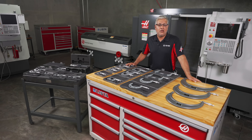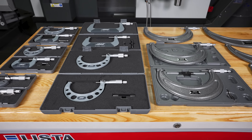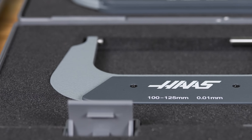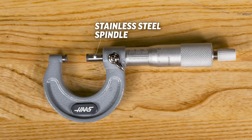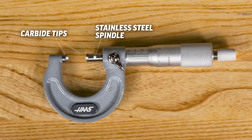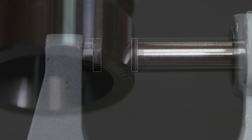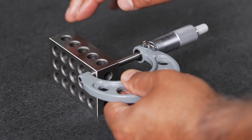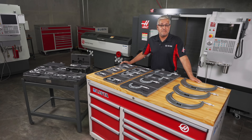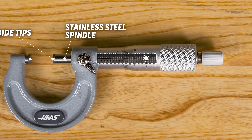Let's first look at our analog OD micrometers in detail. These are high quality precision mics designed to give you repeatable results over a long term. They are built solid like you'd expect. This mic has a stainless steel spindle and there are carbide tips on both ends. The carbide ends are the faces that contact the measuring surface, so having precision ground carbide tips that are more wear resistant will extend the life of your micrometer. The precision mechanism that controls the spindle travel is the threading rod. Traditional mics have an alloy or carbon steel threaded rod, but these micrometers have a threaded rod made of hardened stainless steel that is precision ground and lapped to give you ultimate accuracy.